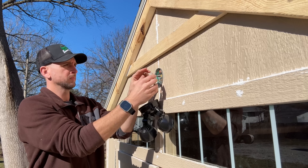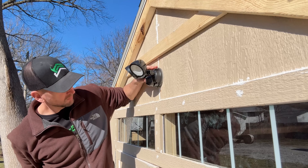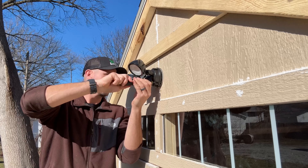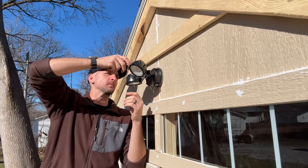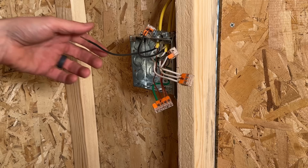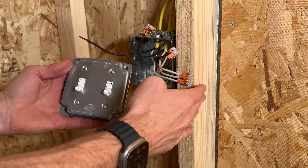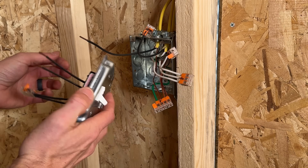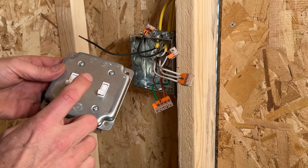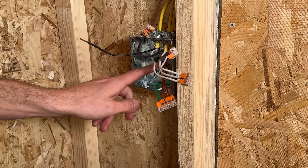Remember we just have a pancake box here and I already have my WAGO lever nuts ready to go. You want to keep as few connectors in this box as possible because the fill factor is very low. Also check the rotation of that box and make sure the mounting bolts location lines up the way you want before mounting. I'll come back with some 100% silicone or exterior caulk and caulk all this to make sure no water gets into this electrical box.